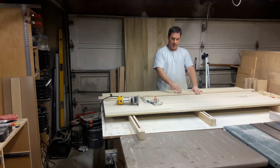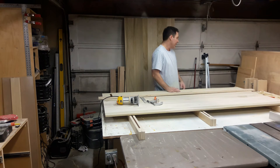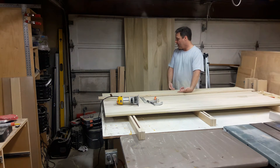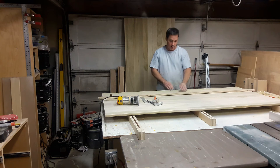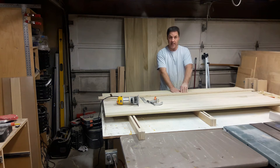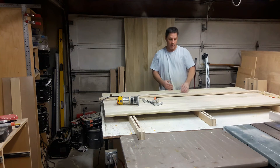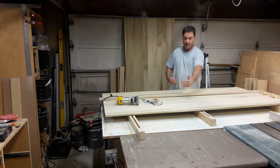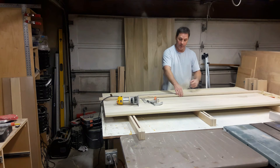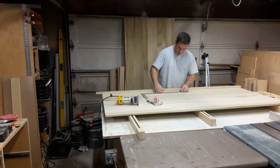For the first board or two I'll clamp in the middle to hold it exactly where I need it from the seam. But as I get further out, I won't have a clamp with a long enough throat. All you have to do is put a board behind this, make sure the center is two inches away from the seam, then back up a board that's perpendicular to this and clamp that back here. As I move out I can just move that board — any length of board about a foot and a half long — and that will hold the middle from bowing toward me as I'm pulling the router.